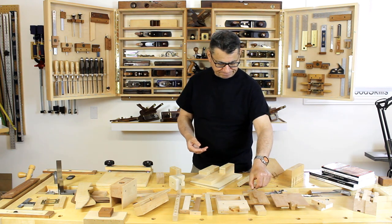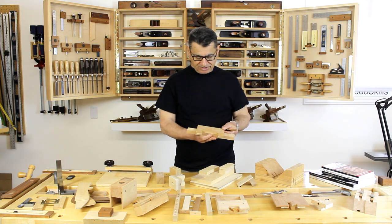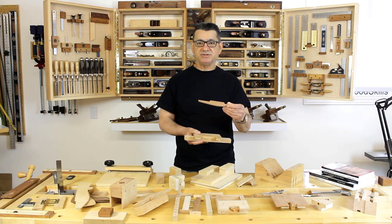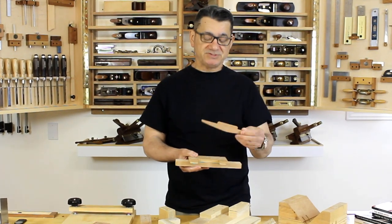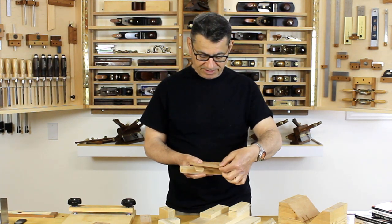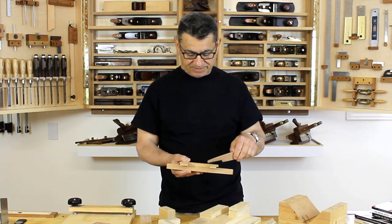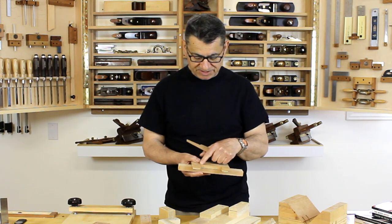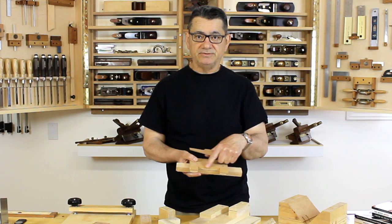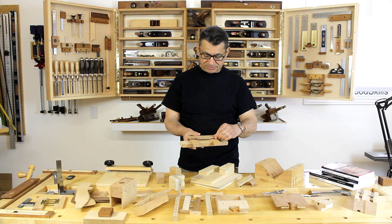Again, in the box making vein, this is another similar type of template jig, used to create an opening for this handle. I used this extensively in my box making. This was a handle for either a drawer or for the top lid. So this would create the opening, and I would just glue this in. It's designed specifically for that. You'll find that the opening is much larger because that allows for the router bit. That's something you need to take into account when you're developing your own jigs if you're using routers. So these two go together.